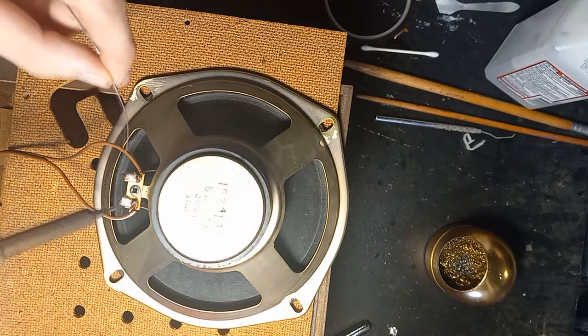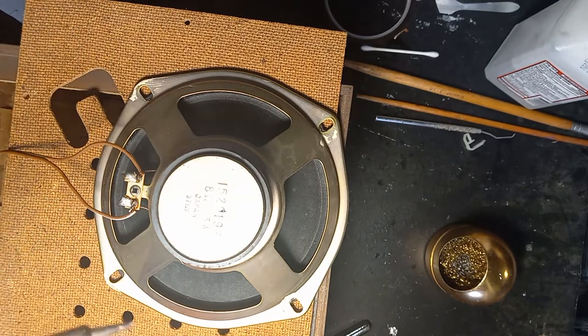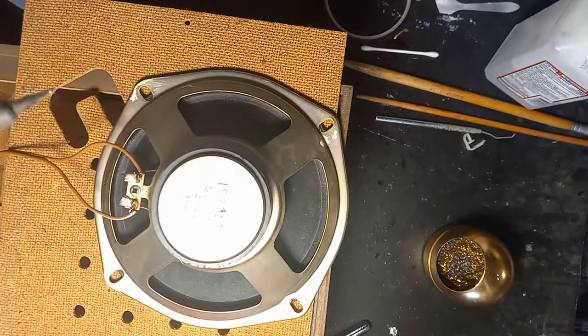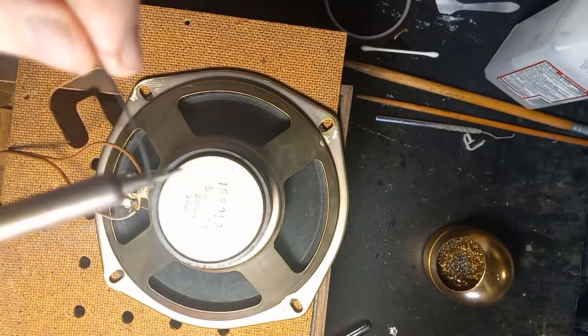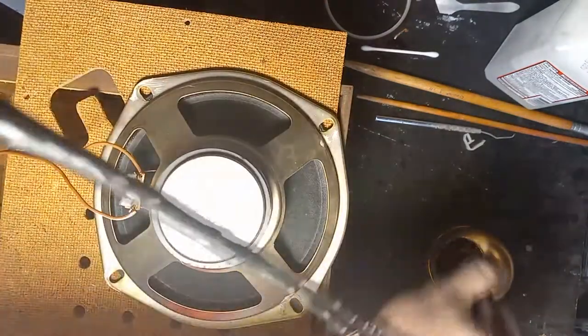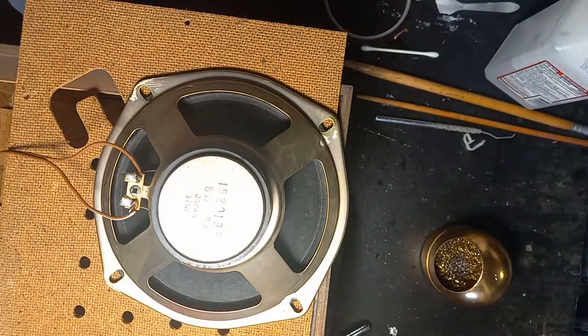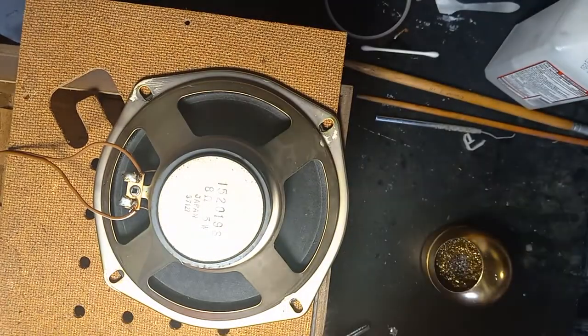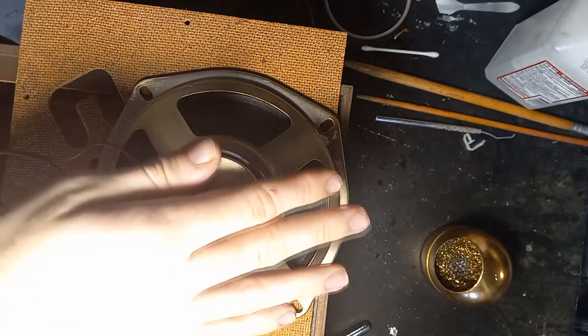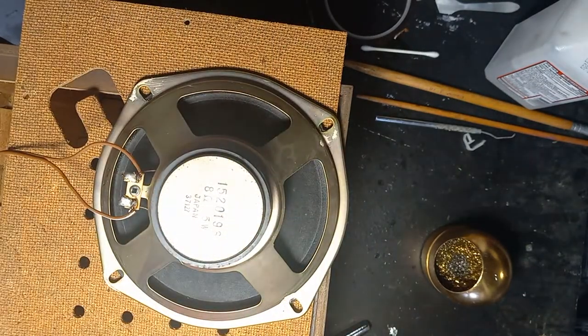The connections look a little bit better than they did before. Try not to get too perfectionistic about it — sometimes all it takes is a little reflow. When I say reflow I don't mean just touching your iron to the terminal; I add just a little bit more solder. Some people believe that reflowing doesn't work; I believe if you add a little bit of solder your connection might get fixed. But is that connection really your problem? Have you done all the troubleshooting? Have you checked continuity, verified good ground, and checked the receiver amp voltages?